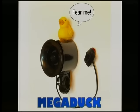We had a 110 decibel bike horn lying around the office. It was actually under someone's chair so that when he sat on it, it would go off. And we had a little squeaking duck thing. So a bit of araldite, wiring the sound output from the duck chip into the amplifier of the horn, and we've got this beauty. So this covers all three of those areas.